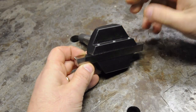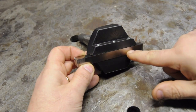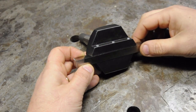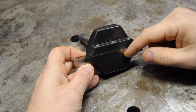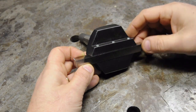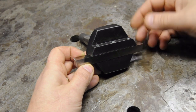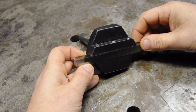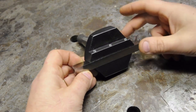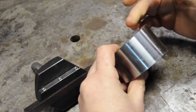In terms of tool retention, it's just a combination of a good fit between the high-speed steel in the slot and the three set screws — nothing more than friction. There are no undercuts, no dimples, no ribs holding it in place. But when you think about it, that's all that's keeping you and your car on the road too.